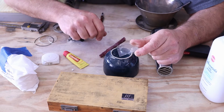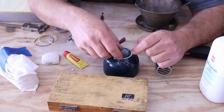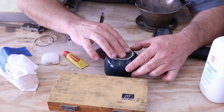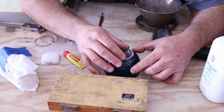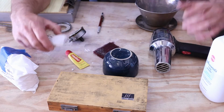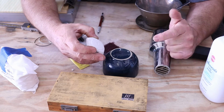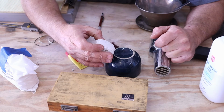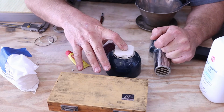So what I thought was, well, I'll cut one out in a circle. So I cut one out in a circle, and I found that the bottom of this bowl is roughly close to what it needed to be. So I made the plastic piece come out to the edge here on the cup. I used the heat gun, heated it up, and warmed the mold up, and then once it got to a pliable texture, where my finger would kind of stick to the plastic piece, I pushed this into it and just held it there until it all cooled down.